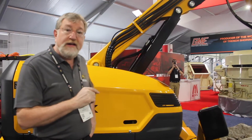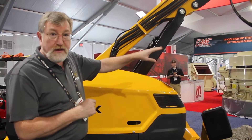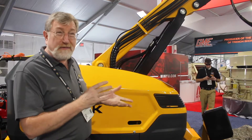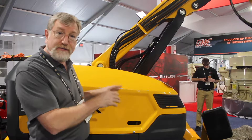The way we've done it is we've increased the strength of the turntable and the undercarriage, we've beefed up the arm, and we've increased the hydraulic capacity to be able to run the hammer, which is about 200 kilos heavier than the 552 that was on the predecessor machine, the 400.